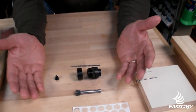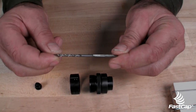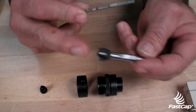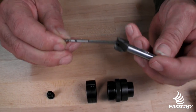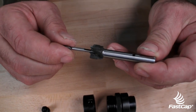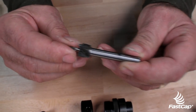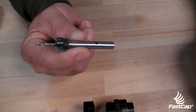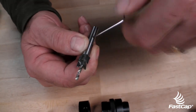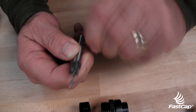The drill bit is made up of about five components. The first thing we have is the centering bit or the pilot bit. It has a little flat on there and it goes into the carbide cutter, which is this one here. When we insert that into there, we want to make sure that flat is aligned. This all comes pre-assembled with the set screw right there. So you push that in and get the pilot bit about the depth that you want, then take the Allen wrench, which comes with the drill bit system, and tighten that up.